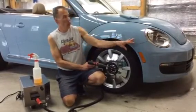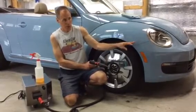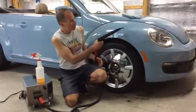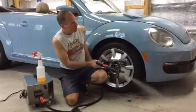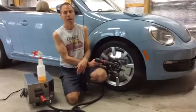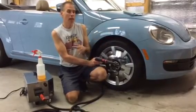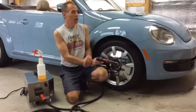That's a byproduct of using steam at higher pressure with the valve wide open — so this is technically wet steam because it condensates as it hits the surface. If you try to clean the surface by holding the nozzle farther away, the steam will be a little drier as it hits that surface, but it won't be quite as hot, which means it won't be effective cleaning. You'll keep the surface drier, but the steam isn't as hot because it's hitting the atmosphere.